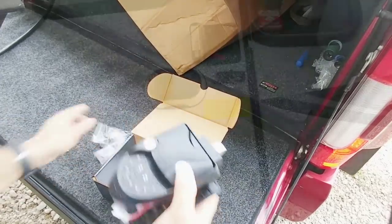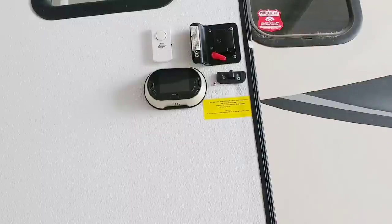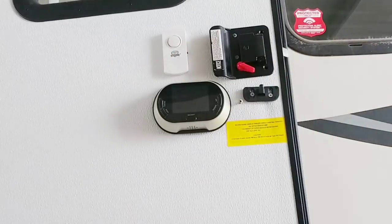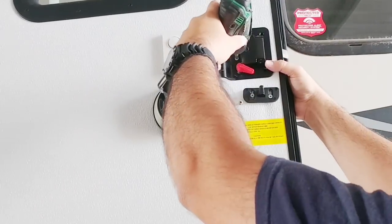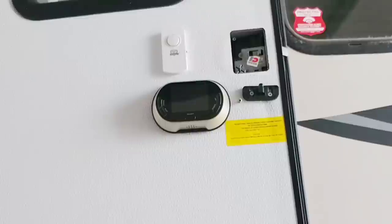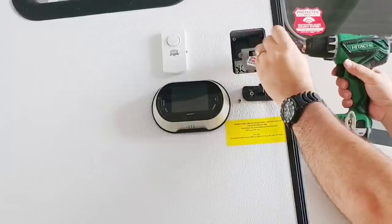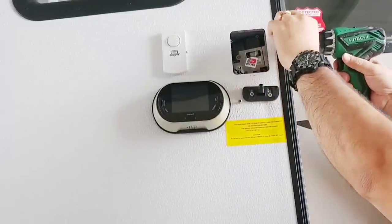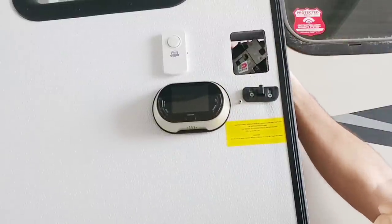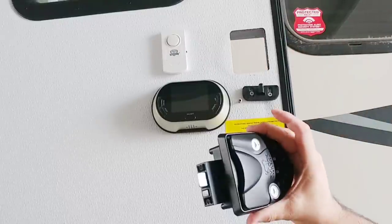This piece is for your threshold. Looking at the lock system from the inside, this is the factory one. Just take out those four Phillips head screws, and then remove the two screws from the side right here where the latch is. First, I'm going to install the outside piece.